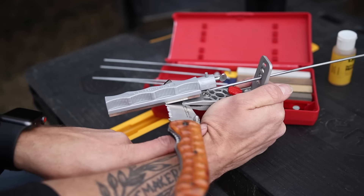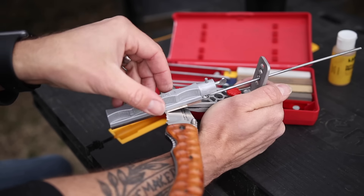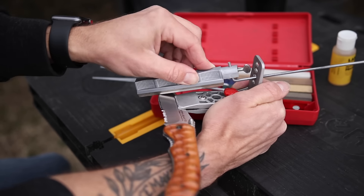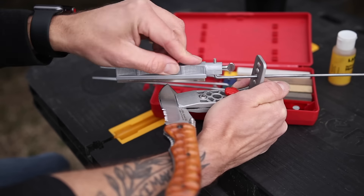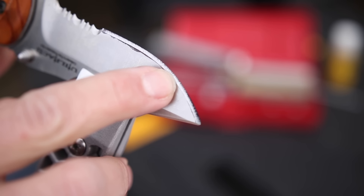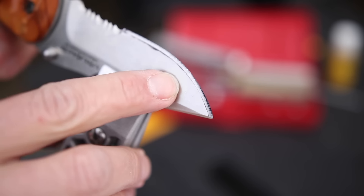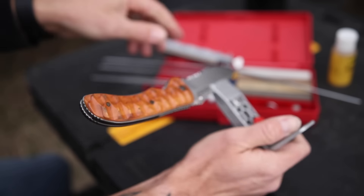We're at the 20-degree angle here. The way you hold this thing: this hand is safe from the blade, and this hand — assuming you keep it on top of your stone in those finger grooves — it'll always be perfectly safe. You're going to apply pressure as you move up and release pressure as you come back down. You're always pushing the grain of the metal into the metal, never scraping it away. Now I'm going to take a moment and show you — if you look at the very tip of the apex, there's still black Sharpie on it. That tells us that we haven't ground down all the way to the apex. It's still rounded over there. I want to watch for when that black disappears all the way to the very edge of the apex.